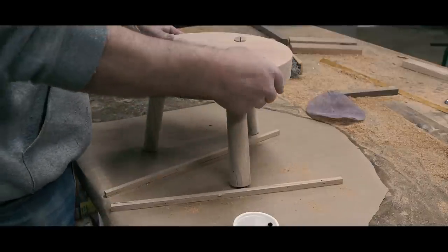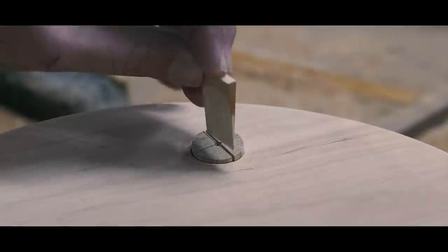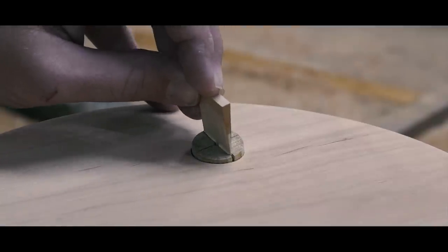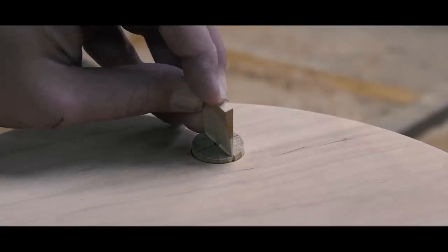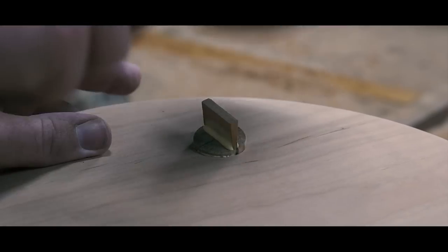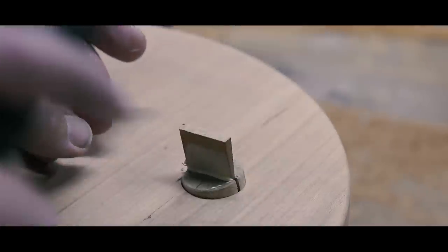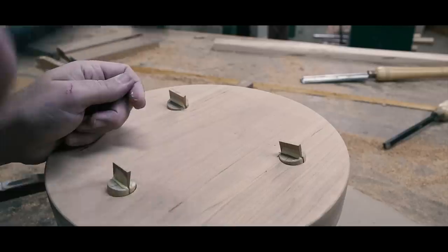Admittedly, I was in sort of a rush to meet the holiday deadline, and I should have taken more time to match the width of the wedges I made to the width of the tenon. Functionally, they work, but there will be small gaps at either side, though it doesn't really bother me too much. I should point out I am driving the wedges perpendicular to the grain direction to avoid splitting the entire seat, much in the same way you can use a wedge to split firewood.